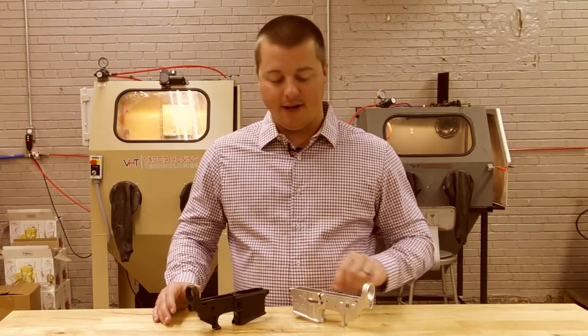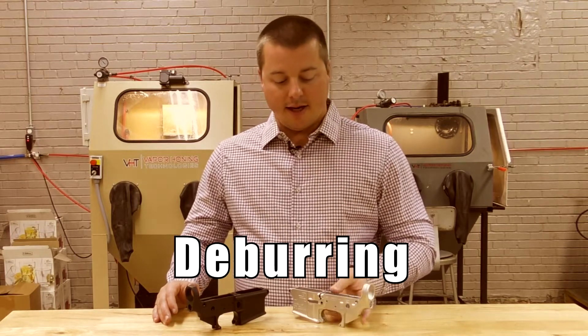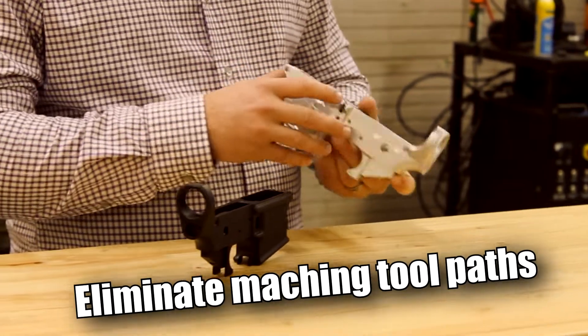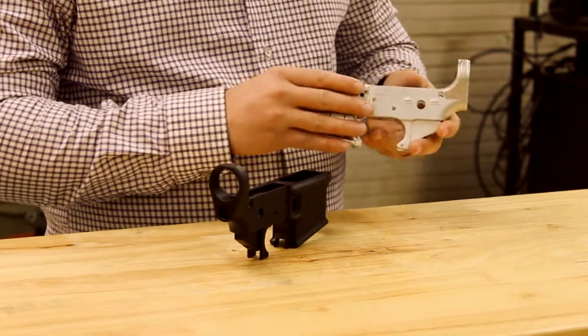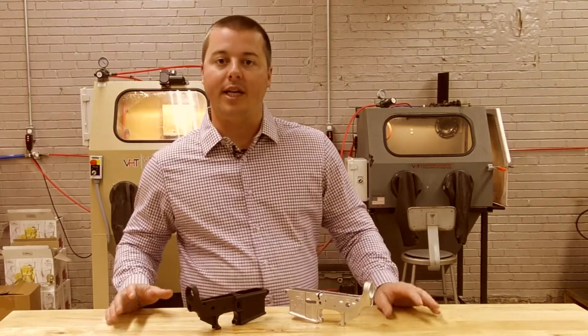In the industry, a lot of times people are having trouble anodizing aluminum or Cerakoting aluminum because of the surface preparation process. What we show is how to properly prep this part after it's machined. Number one, we are deburring the part. We are also eliminating a lot of the machining tool paths that you're going to see on these areas that have been machined, specifically right in here. A lot of your flat areas, you're going to see the tool path where the machine has run.